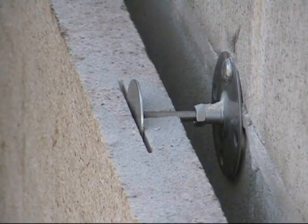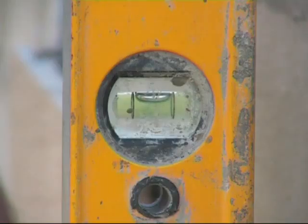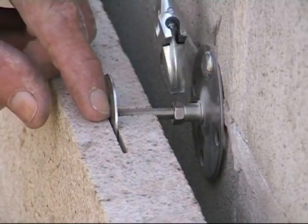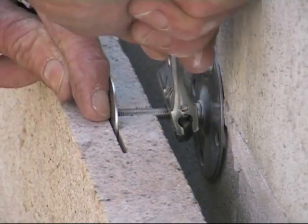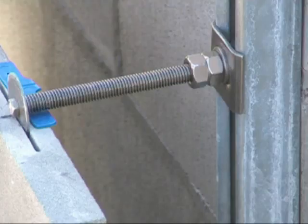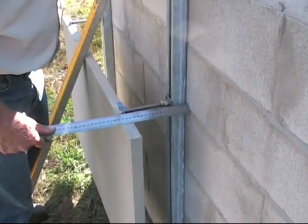You only have one worry, and that is if you have picked the right stone for the project, as it is there until demolition. All the clips are certified to carry load that the engineer has stated in the test results, which are available on the website. But as always, you can't certify the ability of the installer. To keep moisture out of and from freezing in the cut, it is best to insert a bit of silicone into the joint before installing the stone clip.